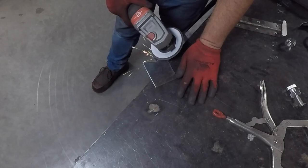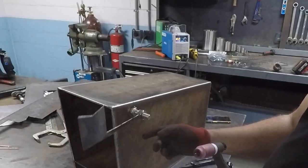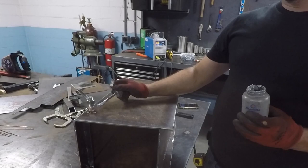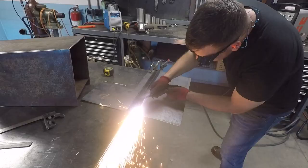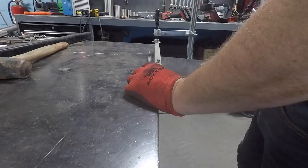I'm cutting a flag out of 16 gauge and I'm going to clean it up a little bit. I also cut a piece of stainless steel piano-style hinge for the door. I welded a nut to the flag so I can spin it on a bolt — never-seize is very important, especially on stainless steel hardware. I locked the flag on with another nut and made the flag so that it bottoms out when it's in the upward position. You don't technically need a flag on your mailbox, but if you send outgoing mail, it's a good idea.